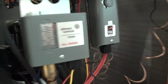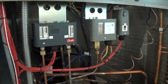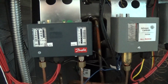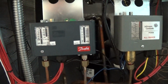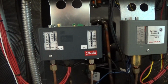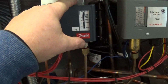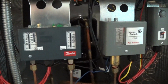On our chillers, all the ones that we do make for both inventory or for customer orders, we do install both low pressure and high pressure adjustable switches. The low pressure is automatic reset, and it'll be preset at the factory here. A high pressure fault requires that you manually come back and reset it here right at the pressure switch.